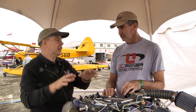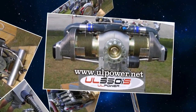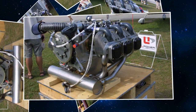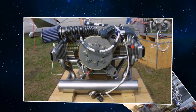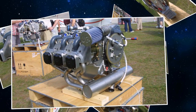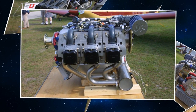A typical new automobile has 400 sensors dealing with all kinds of things in the car, so we're already used to not having to do anything — and now this is true in aviation engines too. A good example is startup in cold weather: a lot of guys coming down here with other engines from up north brought space heaters to warm their engines before starting. With ours, you don't have to do that — it knows the engine temperature, ambient air pressure, and air temperature, so the ECU compensates for all that. And same way if it's hot — if you've tried to start a fuel-injected engine at high density altitude on a hot day, it's nearly impossible. With this one, you just turn the key and it starts. It handles it for you.